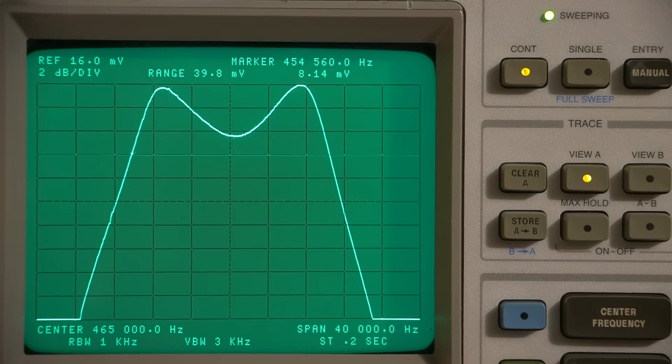So we'll go divided by 2 equals 10.52. Okay, so this is 520 cycles above their audio cutoff filter that they've designed on the underside of the chassis. Can you say Stromberg-Carlson did their homework? What a fantastic job. We're only 520 cycles above. Right, so it's 10.52 each side of the center. This radio receiver will sound absolutely fantastic.